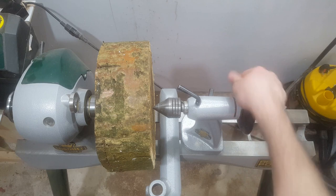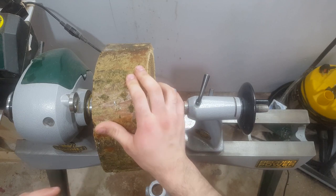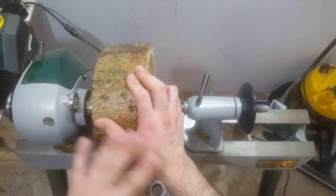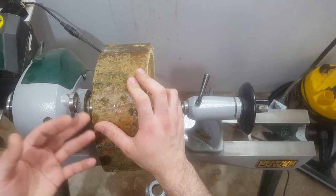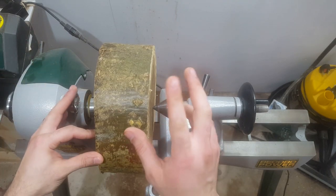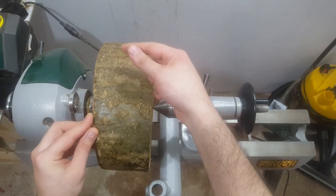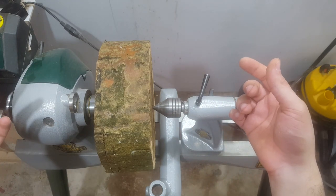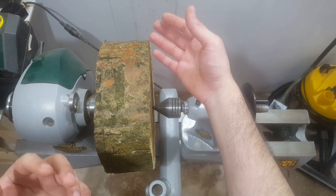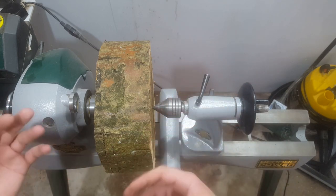When it's heavy logs, someone asked me on my old videos what speed do you use? Thing is, never use other woodturners' speed to determine what speed you should be turning yours at, for a couple of reasons. One is your log won't be the same as theirs. So as you can see, this is off balance. Someone may have a similar size laburnum, but the off balance is somewhere else, or it may not be off balance